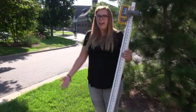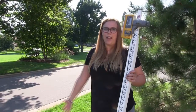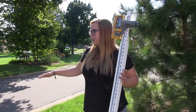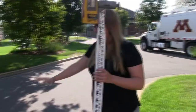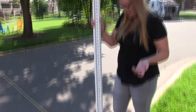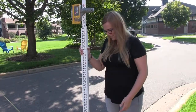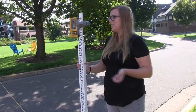If it seems pretty flat, you might measure every foot or every half meter — whatever feels like it's enough to accurately show what's happening on the cross section. Where there's a change in elevation, you want to make sure you're capturing the whole thing, so you might go in very small increments until you've shown the complete change in elevation.